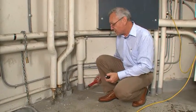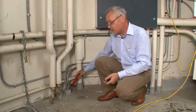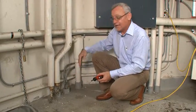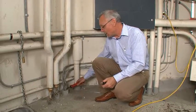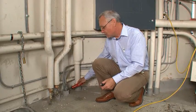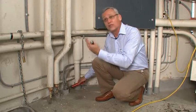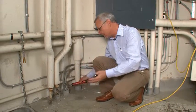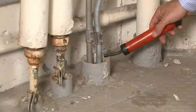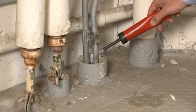To rectify this, we'll stuff it with foam — a one-part gun foam — and then a fire caulk material over it. Because this is a rated room, we need rated products. The smoke is coming up, but if someone opens a door on the other side of the building, the smoke will actually go back down — pulling air from here back down into the conditioned space. We want it totally compartmentalized. There we go — a change of pressure and now the smoke is going back in.